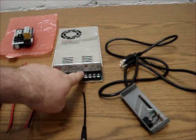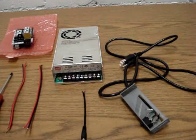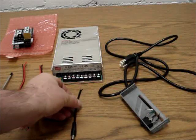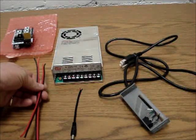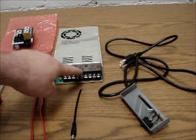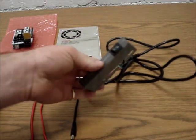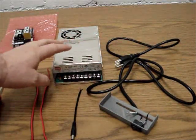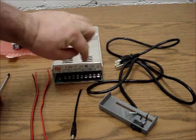You can actually hook up all the power to just the two middle terminals if you want, or split them apart. For the lighting connector, since they're so close together, we're going to put V-plus and V-minus on the inner two, which makes it a little easier. One thing to note: I printed out this cover. One problem these power supplies have is they don't have a switch, because they were meant to be in a larger chassis.